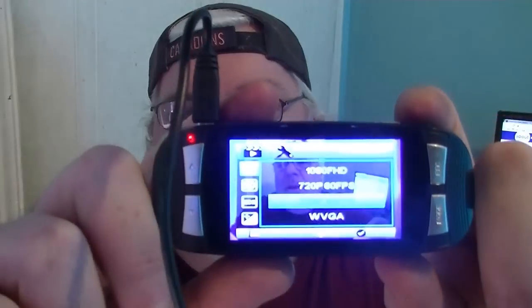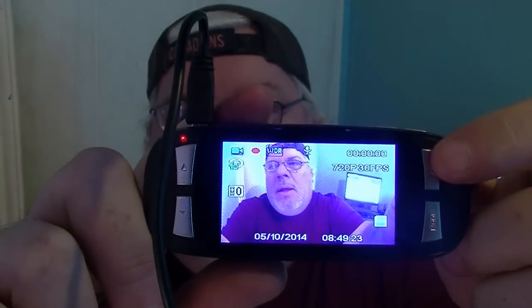60fps will help you capture license plates at high speed. However, these cameras inherently drop frames at 60fps because they can't keep up with the bitrate requirement for that speed. To keep up with the processing, the processor will just start dropping frames. So keep it at 30fps in my opinion. If the camera were in a stationary location where the background didn't change much, the processor would be able to copy that static background over to the next frame without reprocessing it. Anyway, we'll go out of this menu and back into video mode.